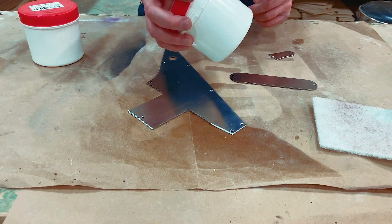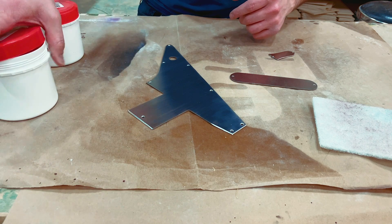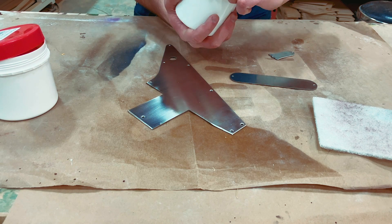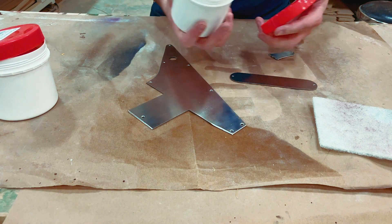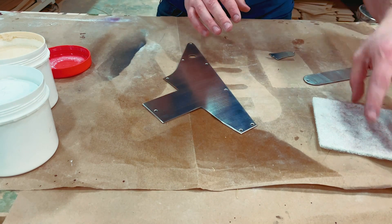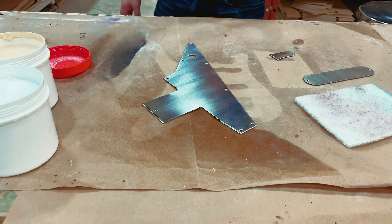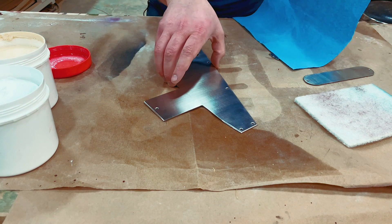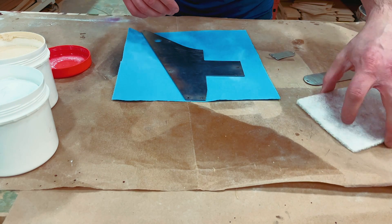The 2L is great for a lot of things — frets, buffing the back of a guitar neck to make it smooth without being perfectly glossy. The Jeskar Paste 16 is the finer stuff — it looks more like your standard metal polish. The first thing I'm going to do to preserve the graining pattern is use the 2L on the back. I'll put something down to avoid scratching it. Stainless isn't exactly easy to scratch — it's really hard — but we still don't want to risk it.